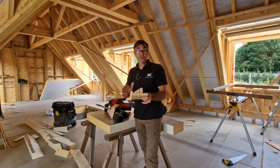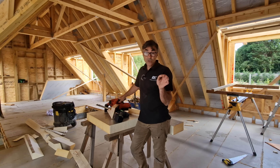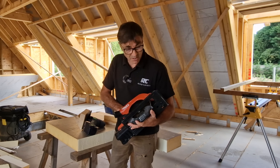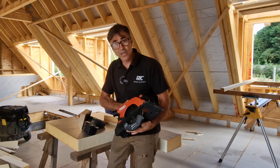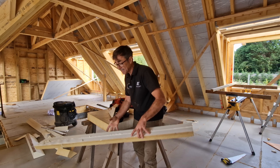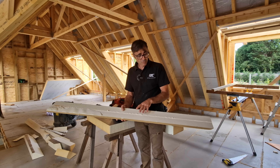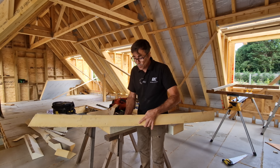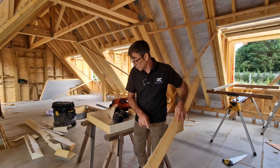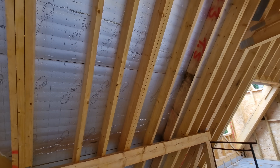It's very straightforward — just rip them down — but I will stress you do need very good dust extraction. With the circular saw I didn't use a polycrystalline blade with only three teeth; I've just used one of my older blades. Because I'm not cutting all the way through and I've got dust extraction, the dust comes all the way out of the cut and straight into the extractor with no residual dust — much much safer. Once I've made the cut I just snap it through and clean off that little bit, because the saw blade gets me nearly all the way through.